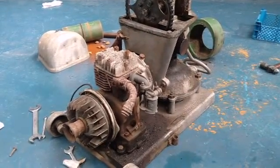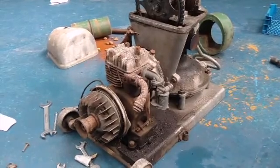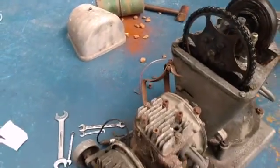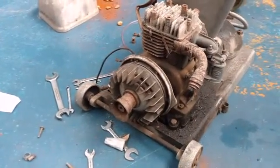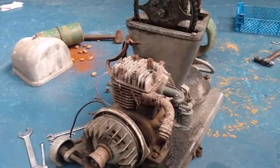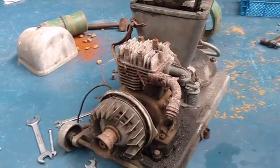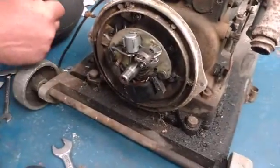We have a Simplite trash pump powered by a Villiers Mark 10 four-stroke. It's sat for quite a number of years. You can see what's dropped out of the tank there. We're just trying to get a spark out of it at the minute. So we're going to pull the flywheel, set the points, take the cylinder head off to find the five degrees before top dead centre and see if we can't get the old girl running. There's the points here on this beautiful British stationary engine.